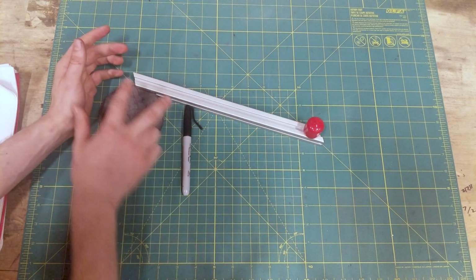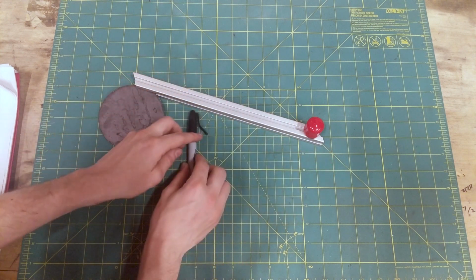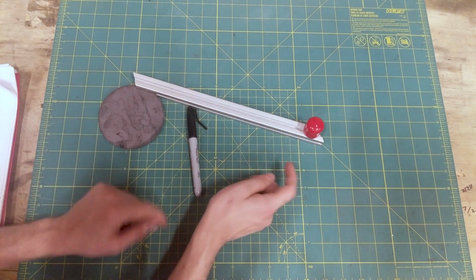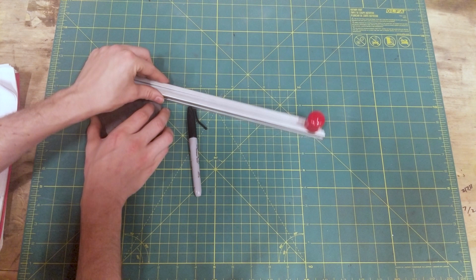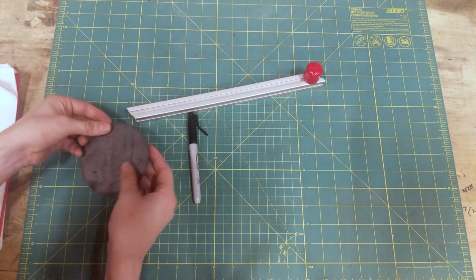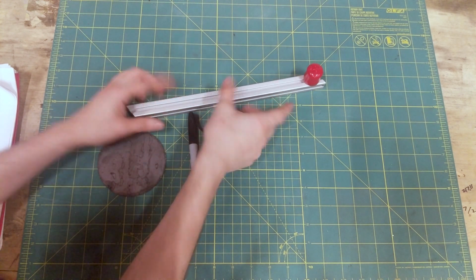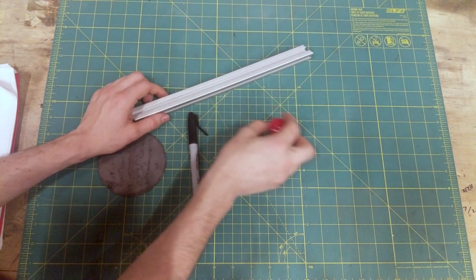The real magic here is the ratio of the lever arm from the weight to the projectile. The lever arm for the weight is much shorter than the projectile, and what that allows you to do is when this weight moves a little bit, the projectile moves a lot. So this arm can move maybe 2 inches in 1 second, but that would require this thing to move maybe 8 inches in 1 second and shoot this projectile into the abyss.